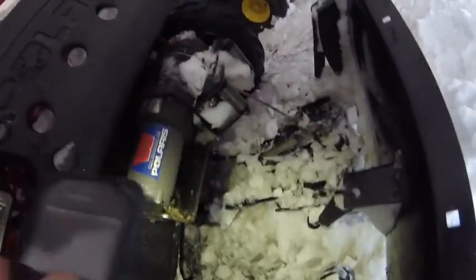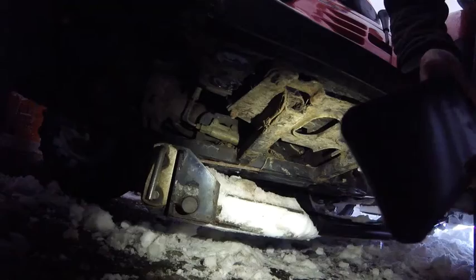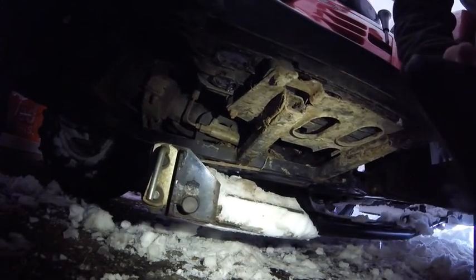I was like, what the heck, my plow is broken. I thought a bolt was coming loose - a bolt right there in the front, like a pivot bolt or something. But that wasn't the answer. You see this right here, this plate, and the holes going through it? There's supposed to be a u-bolt right there, but there's no u-bolt, so the whole entire plow can just move back and forth.